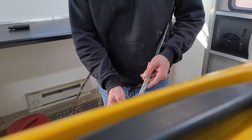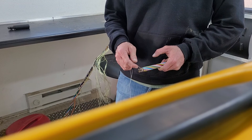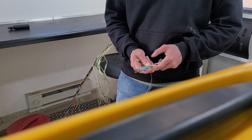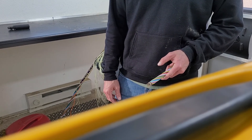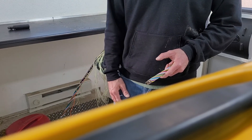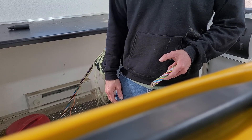That can be complicated sometimes if it's an older cable. Sometimes they have memory. You'll learn over time that there are different mid-spanning tools for the buffer tubes that work better than others for that reason. I have about a $1,000 buffer tube mid-spanner and I love it because, knock on wood, I've never broken a buffer tube with it. Versus other tools I've used — I've busted so many buffer tubes it's not even funny and taken down customers. That's just a risk with very old cables underground or around water.